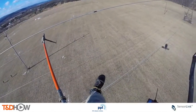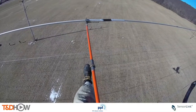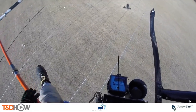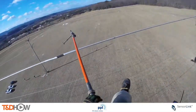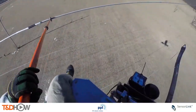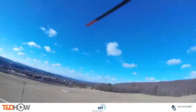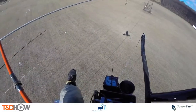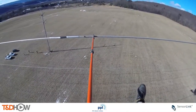Now let's return to our Pennsylvania splice that we have determined needs repair. The first task is to take some resistance readings with a radio ohm stick attached to the orange hot stick. Our aerial lineman takes readings on both sides of the splice as well as the bare conductor wire. The bare conductor reading shows 12 micro ohms, side one of the splice shows 10 micro ohms, and side two shows 53 micro ohms — giving a resistance ratio of 4.42. This tells us that one side of the splice has more than four times the resistance of the conductor it is connecting, indicating a splice in need of repair.